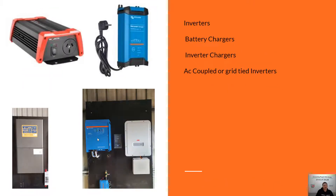The next major component you're going to want is an inverter. What an inverter does is take the DC — direct current — from your batteries and turn it into AC, alternating current, which most of our appliances run from in our houses. The cheapest and easiest way to do it is to buy an inverter and a battery charger separately. The inverter will take the DC and turn it into 110 or 240 volts of usable power, and the battery charger is designed so that in bad weather you can start your backup source and charge your batteries in a more controlled situation.